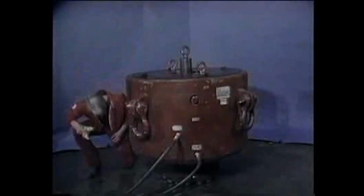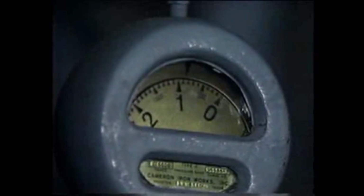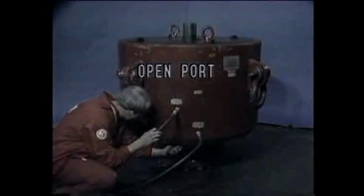If there is a continuous flow from any of the ports, there is an internal seal leak. Refer to the D Maintenance Manual troubleshooting section. If there are no leaks, zero the close pressure and again remove the hydraulic line or the pipe plug from the close port. Connect the hydraulic open line to the open port or reinstall the pipe plug.